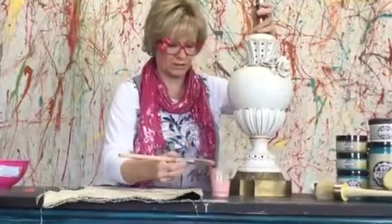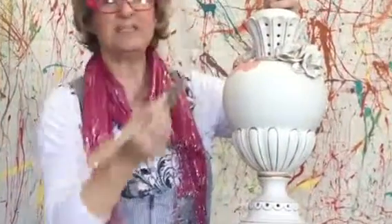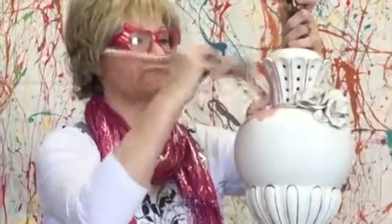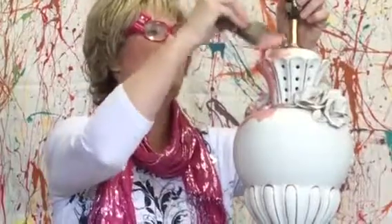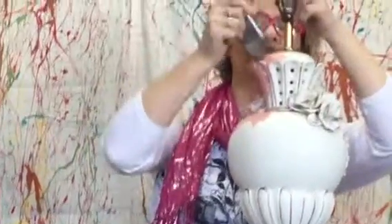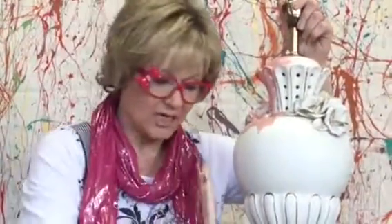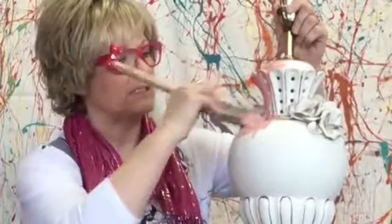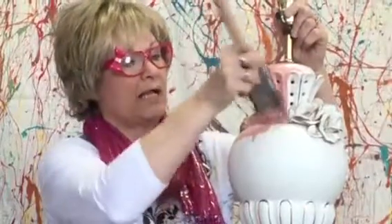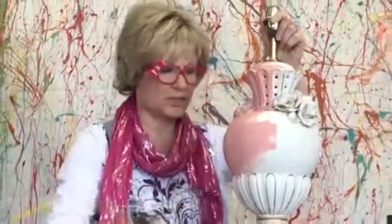I come back, put them in some hot water, and the paint falls right out. A lot of times you think too much before you start a project — you go, 'okay, I have to do this and that.' No, you don't. Just start with our paint. You'll notice I'm painting around the hardware because with PIY paint, until it is sealed it doesn't stick. So if I'm painting a dresser or kitchen cabinets, I paint right over top and then come back and wipe the hardware off with a Q-tip. Look at how beautifully it covers that ceramic!